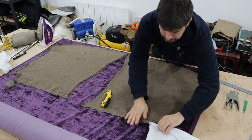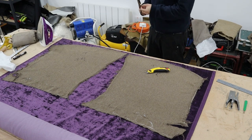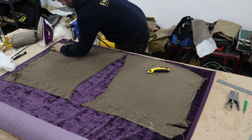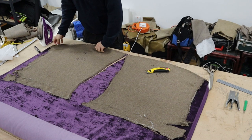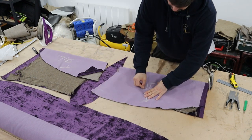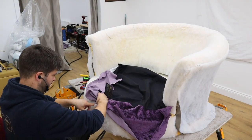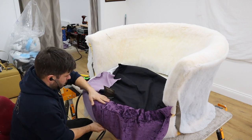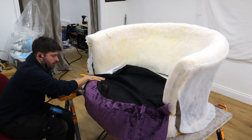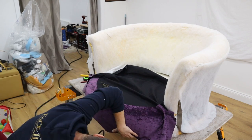I'm just going to tear that lining off. You can see here that they've both got the same cut, so it looks like we're going to have to make cuts ourselves on the frame. Now we're just going to mark these panels: top inside back left, inside back right. What I'm doing here is using my soft tape measure to find the exact middle of the frame, because there is a seam join in the middle of the fabric. I'm going to staple that off, then from the middle I'm going to work my way around, making sure the selvedge is all down in the same place and it sits nicely, then start working my way around and stapling towards the end.